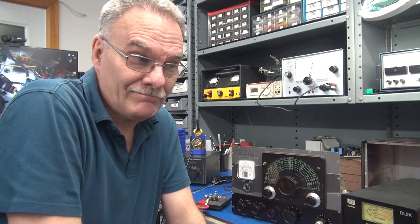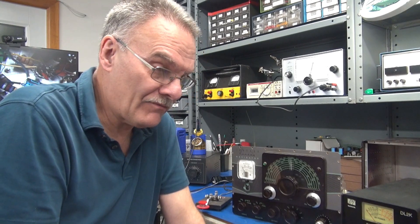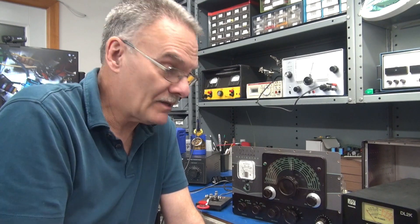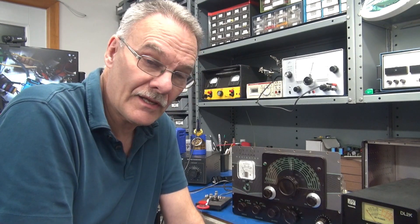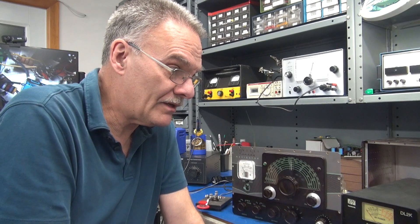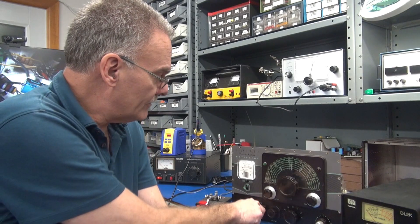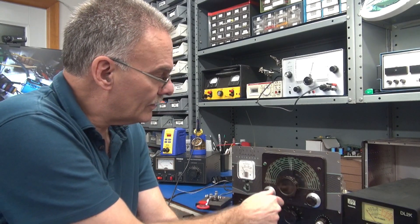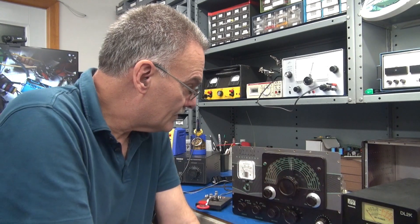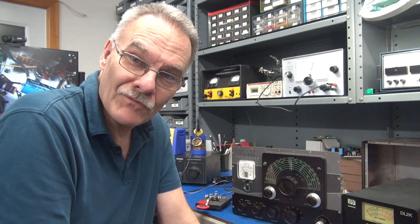This little Navigator is getting me. I corrected the screen problem — I found that the wire going to the screen was just on a terminal board going to nothing. I think somebody may have been externally switching that at one time. I put that back where it belonged, and I now have 150 volts on pin 3 of the 6146. But still nothing. When I'm going to zero, adjusting the exciter, I should see some grid current — I see nothing. So we've got either an issue with the VFO or the driver circuit.